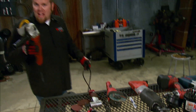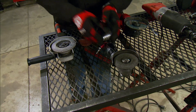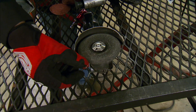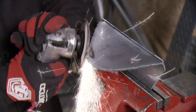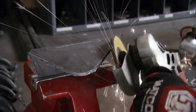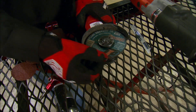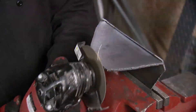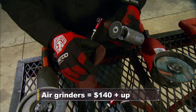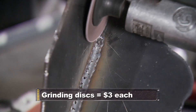When it comes to metal finishing, you're going to have a grinder in your hands a lot. The two main players are air-powered or electric-powered grinders. There's lots of different stone options, but the two used most are a pure stone disc for that first initial grind, and then a flap wheel to finish it off — these come in different grits like 50 or 36. When you're done grinding with one of these, you'll never know the steel was cut or welded. You can even use a small four-and-a-half-inch cut-off wheel and turn your hand grinder into a mini chop saw. Also handy is a small air-powered three-inch unit with scotch-brite pads great for cleaning up welds, and a grinding disc for getting into tight spaces.